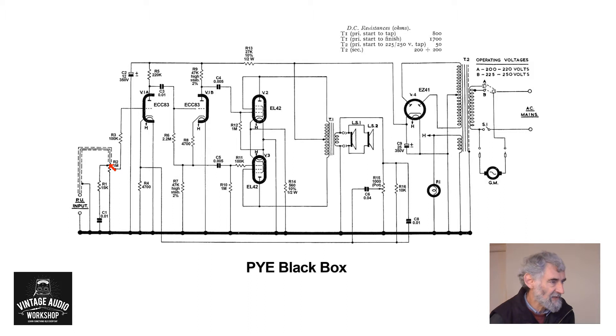We don't have a great deal of gain in this. You will notice the tapped pot for the volume, which is a difficult item to replace because you won't get tapped pots as new production anymore. The reason for this is tonal correction at low levels, called loudness — so you've got a resistor and a capacitor, and it's something of a top cut. To be done correctly it would need to boost both treble and bass relative to mid, but that's rather more complicated. There is another version which has a separate pot for the correction, appearing as a stereo pot on the input for a mono input.